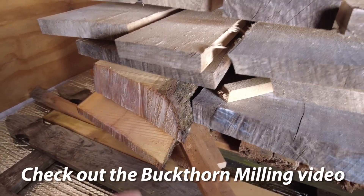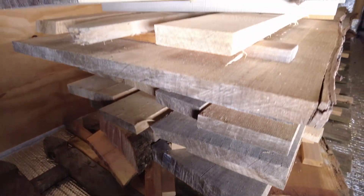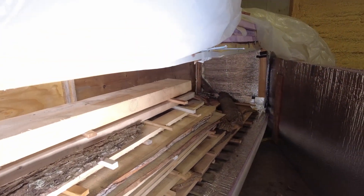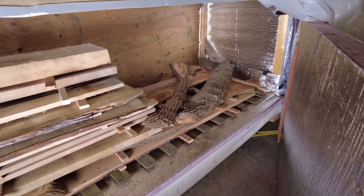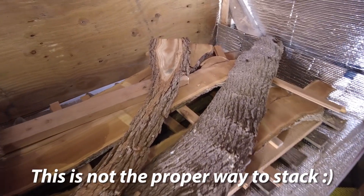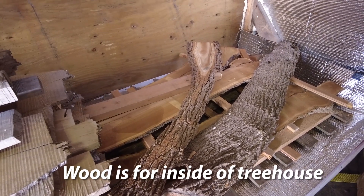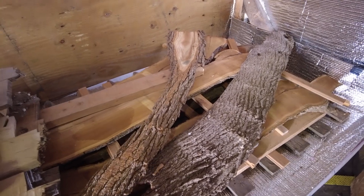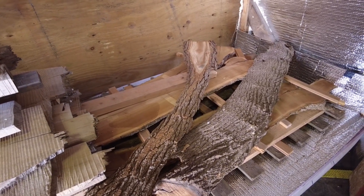I have the buckthorn loaded into the kiln. These pieces down here I put on the bottom of the stack, and I had a bunch of other silver maple that has been air dried for a few months, so I just piled everything up high on top. Over here we also have some Osage orange which I milled a while back, on top of everything to weigh it all down. But the Osage orange that I've milled and air dried for about nine months has not dried straight — it's pretty crooked. So I'm not really worried about that area. I'm just going to throw some bags on top and try to salvage what I can.